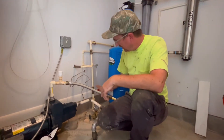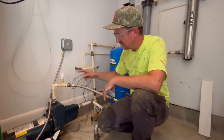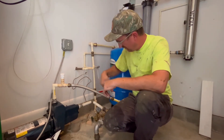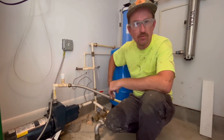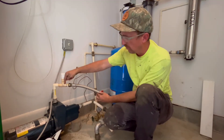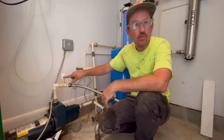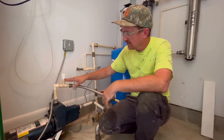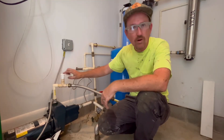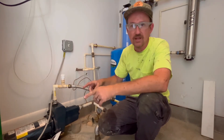When pouring water in, make sure the valve is off so that water is not flowing in multiple directions or losing prime. Ideally you want a shutoff valve between the pump and pressure tank so you're not having to prime the pressure tank as well. Pour water in and wait until the water level rises all the way to the top — watch it to make sure all the air is released and the water level doesn't drop again. If you see that water level drop, pour more water in and keep monitoring. If it continues to drop, there's still a leak in the suction line somewhere.